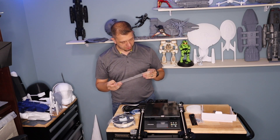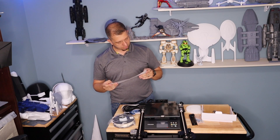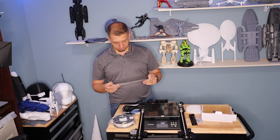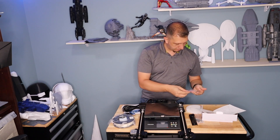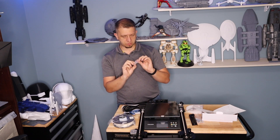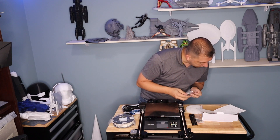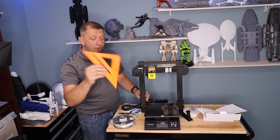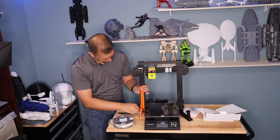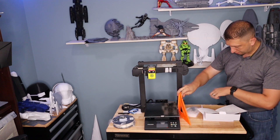So the quick start guide has four steps: straighten the machine, install the material rack, insert the FFC flex cable, and check screws. Not bad — let's get about it. They even include some spare nozzles, which we'll look at in detail in the next video. To start, we want to get the frame at a 90-degree angle — I grabbed the carpenter square to make sure this is sitting at a good 90 before tightening it up properly.